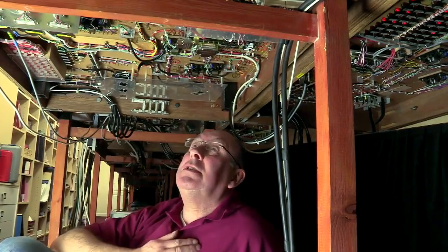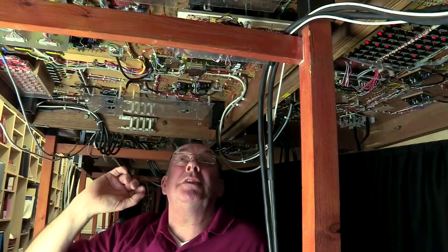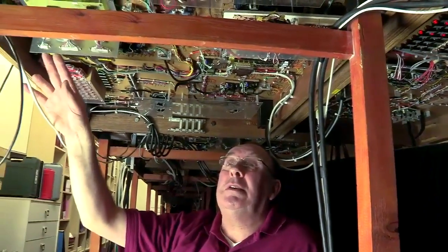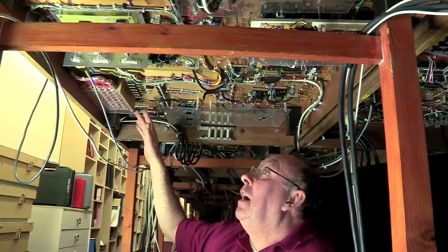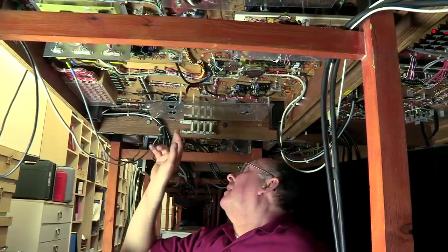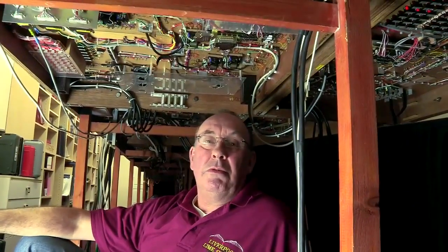If you look here now, you can see various bits of circuitry. Here is the circuit board that controls all these servos that are operating those signals that you saw before. Over here we have a node which is for controlling the signal servos. Here we have a bank of relays which control all the polarity of the frogs on the point work, and here the various point motors. And finally, over here, the big box of tricks with all the processors in. So I don't want to bore you anymore with all this. Why don't we go and watch a few trains?